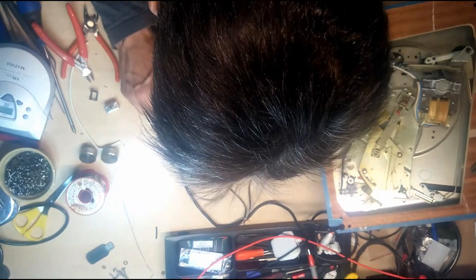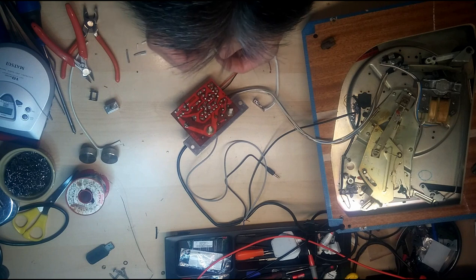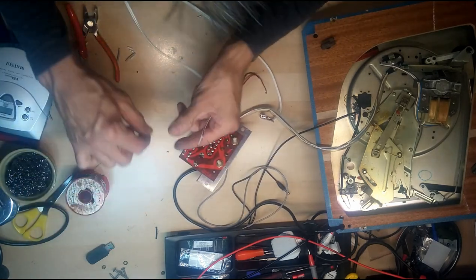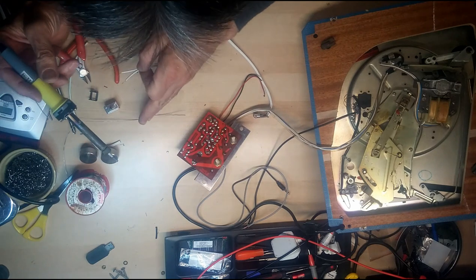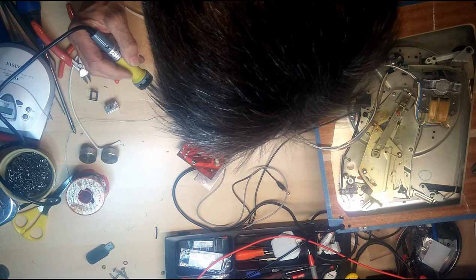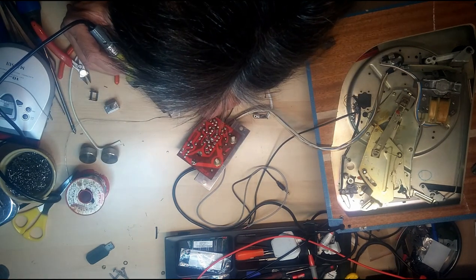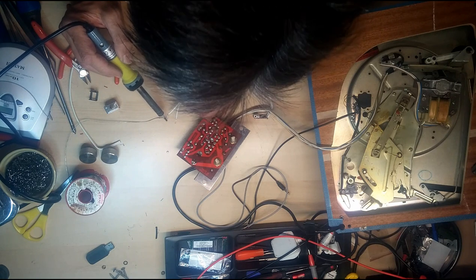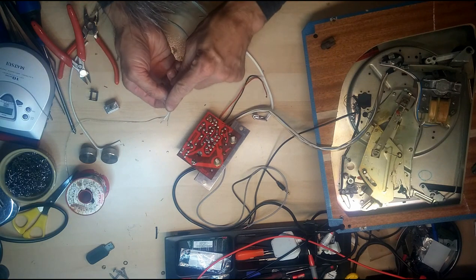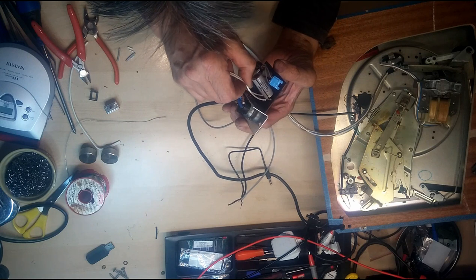So we want to connect to our positive and our negative from this board, and I will bring them through from the other side with the rest of the wire. Now remember, I use the one with the tracer as the positive, and again I would like to tin these first, so let's just do that. One with the black tracer is positive. Your cable may be slightly different colours. My one, it's those.